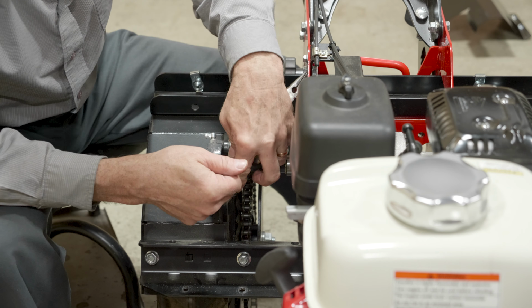See there along the shaft, we're going to go to the outer position. Put that outer one in there. We want to make sure that snap ring is seated well in its groove. There are a series of grooves along the shaft, and there's a C-clip on both sides of our sprocket. So we move our sprocket over, and then we can move the Woodruff key first, because that's what has to keep that sprocket from turning.